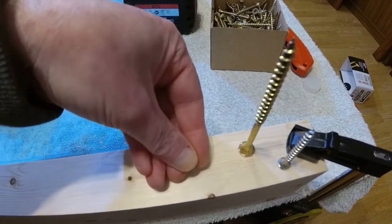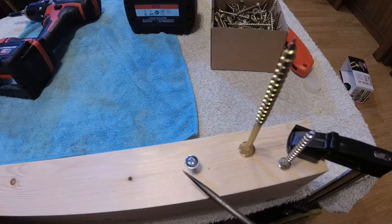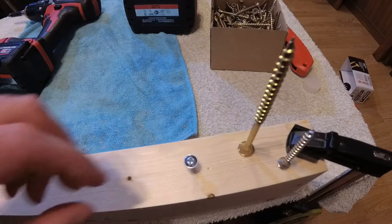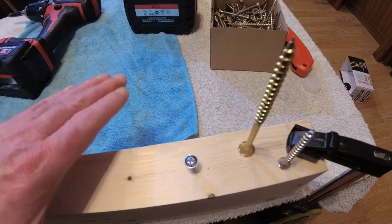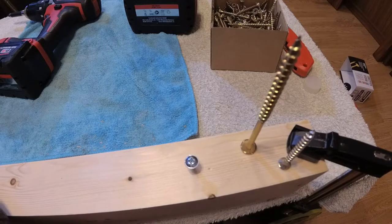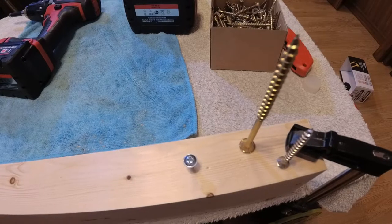This isn't a pan head — this is a dome head with a built-in washer on it. What this does is when it goes into the wood it actually holds it flush, and in a way this is what these screws are trying to do. I'll put some screws in and show you them going in using the Milwaukee impact driver, turning the top settings up a bit.